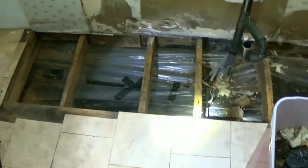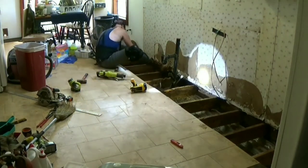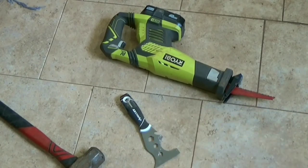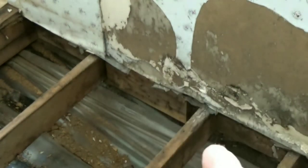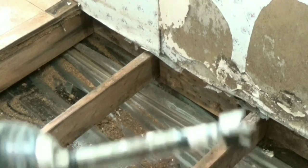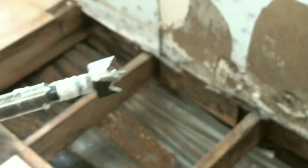Okay, finish off that, go ahead and clean it up, draw my chalk line, come back here to four feet, go ahead and cut out this section. Then I'll go get my insulation, put the fans on, and hopefully lay my insulation down and pop the floor back on. Pretty much a combination of the sawzall, a 14-in-1 or 5-in-1 tool, and a Forstner bit at the end of a drill — that seems to clear out all those little cavities between the base of the wall and underneath the floor joist. It's soft particle board, so it disintegrates pretty easily. But this doesn't eat into good wood nearly as easily as it does old wet particle board. Pro tip!